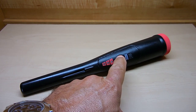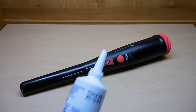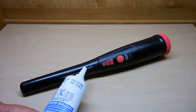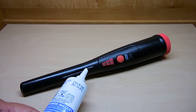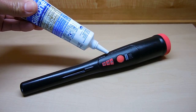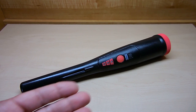I took silicone glue, cut the tip at a very sharp angle, placed it over the areas to seal — like over each LED opening. I pushed inside the opening and squeezed to inject silicone in and around each LED, forcing it inside the housing. Even where no leakage was detected, I still sealed it. I also ran silicone along the entire seam around the whole panel perimeter, then smoothed it with a wet finger to make it look neat — not sloppy.